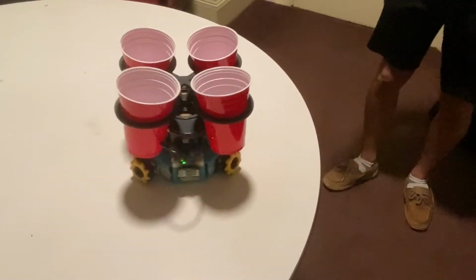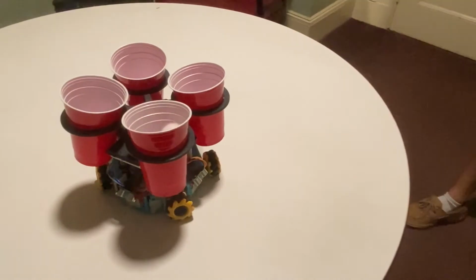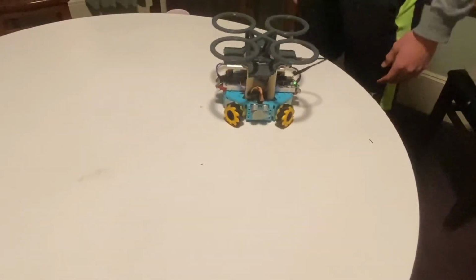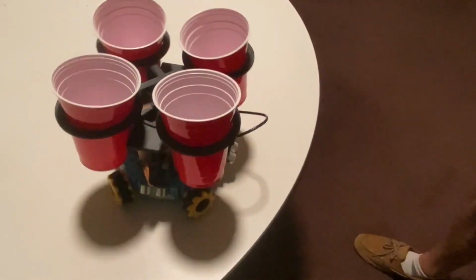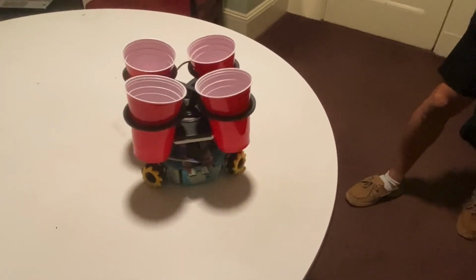Furthermore, the sensors would randomly detect distances of about 800 centimeters. However, this error fit well with the code, as the robot would turn different directions when reading distances of over 90 centimeters. So the reading of erroneous distances of 800 centimeters added yet another level of safety for the robot, thus making it avoid falling off tables and crashing.